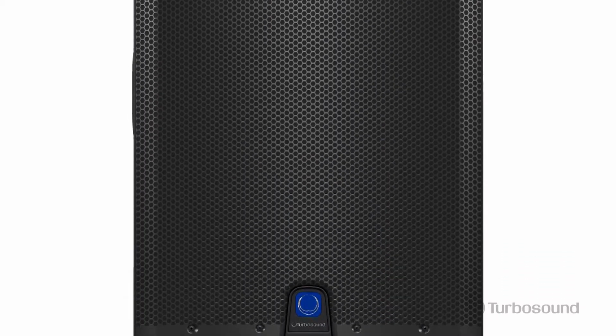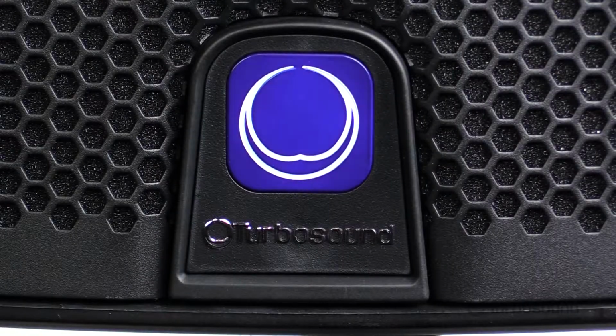On the front, we have a powder-coated perforated steel mesh grill that protects your 15-inch low-end frequency driver and your 1-inch compression driver. Here we have an on, off, or limit light, which you can set however you would like. Now, if you have it set to limit, that's a great feature since you can see it from a distance. And if it's blinking, that means that the input level is just a little bit too high. You might want to come down on it a little bit.